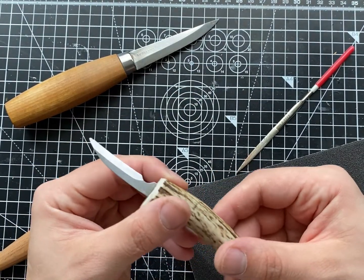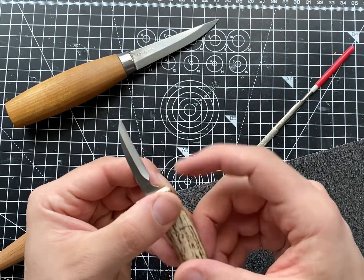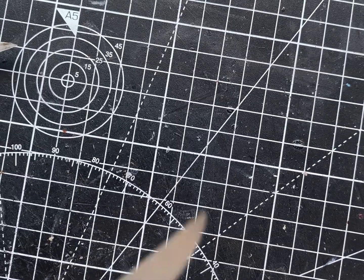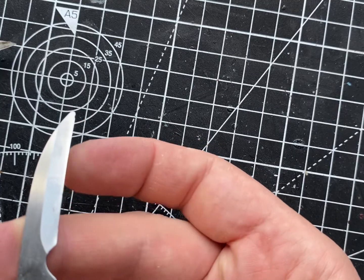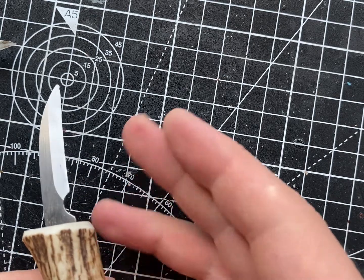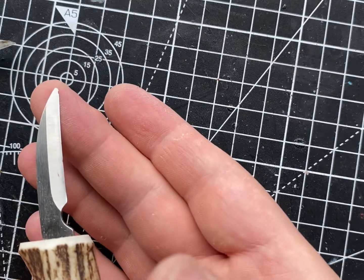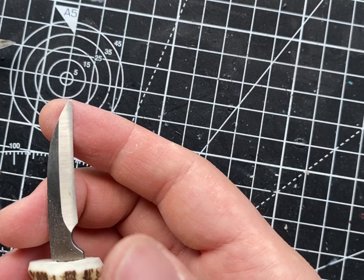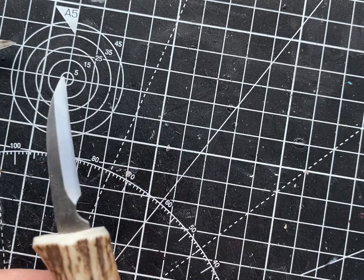The second problem — because the nick was so small — just the process of sharpening the blade will wear enough of the blade away to get rid of that small nick. If it were larger, we would need to grind down the front of the blade back to the deepest point of the nick. A nick may not seem like an issue visually, because the knife will still technically cut, but it will start to tear the wood. If you don't correct it soon, that small nick can fracture and turn into a much larger one, because you've weakened the knife edge at that vulnerable point.